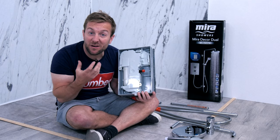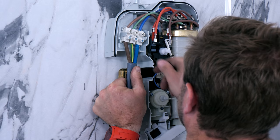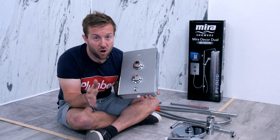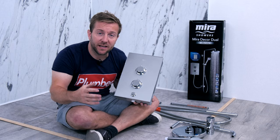We're going to have 10mm cable coming into this because this is a 10.8 kilowatt beast. Cable can take up quite a lot of room, so make sure you've got enough room for your cable. I'm not going to fully show you how to do the electrics in this video — you should always get a qualified, competent electrician to come in and do all of that work. Also worth saying, the dual outlet version is only available on the 10.8 kilowatts, because if you have a lower kilowatt rating you're going to need those extra kilowatts to get the water up to temperature.